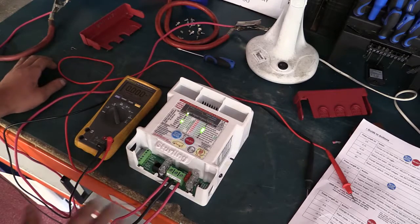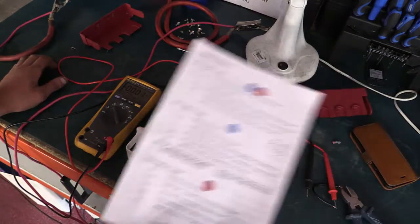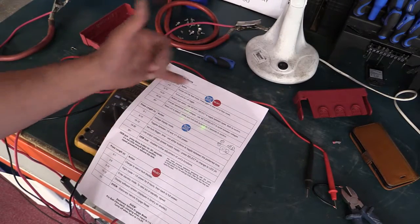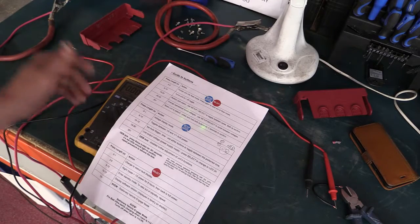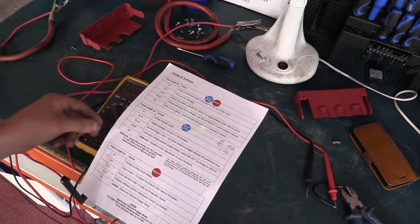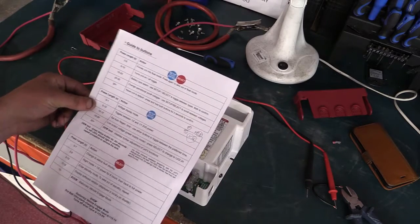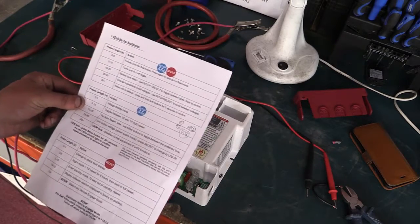The common thing that people are doing with these units is accidentally putting the unit into off mode. If we look at the breakdown sheet, we'll see that if you push both the setup and select buttons down together for five to ten seconds, it toggles the unit off. To toggle the unit back on, I'm going to show you the correct process. If you're doing this on first setup, you have a window of opportunity to return the unit to on a lot more easily.